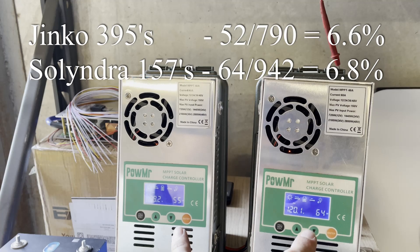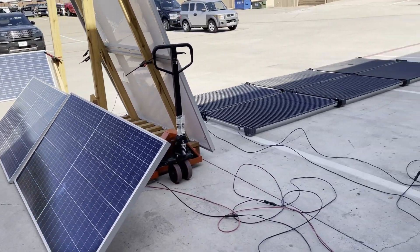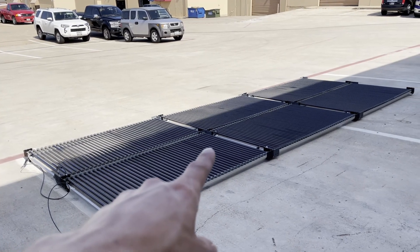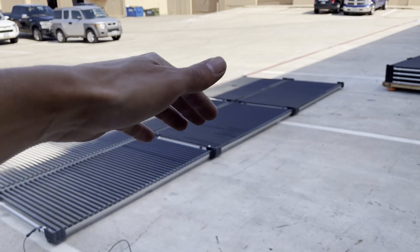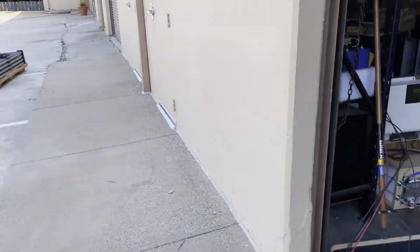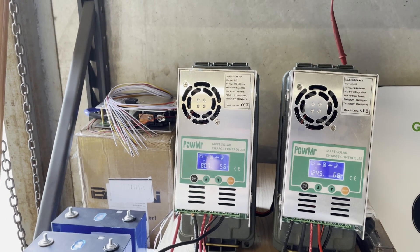The shading performance looks about the same between the two — this is about 800 watts and this is about nine hundred and change. Here is our 800-watt array; the sun's starting to come across, and then of course our Solyndra array. Now if I had these set up in other orientations so that those two were getting full sun and the sun was coming across this way, once those two got full sun we would have a series string in full sun and start getting probably a couple hundred watts. But the way it's set up now, I'll have to wait for the sun to hit the full array.